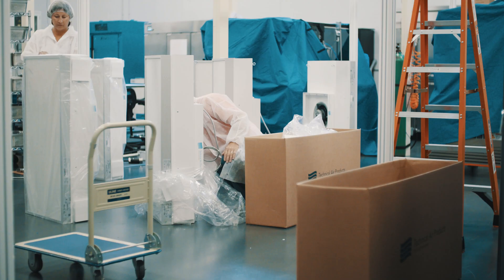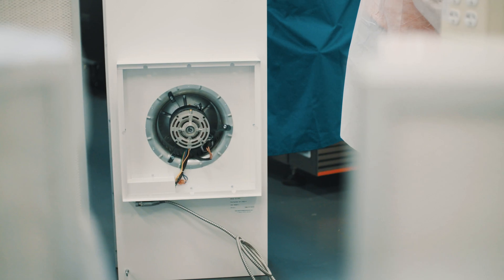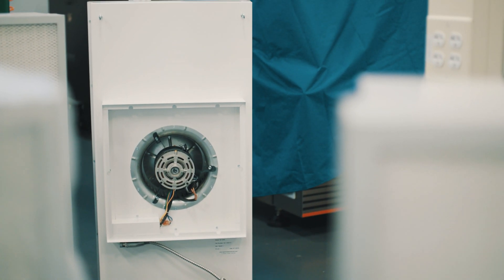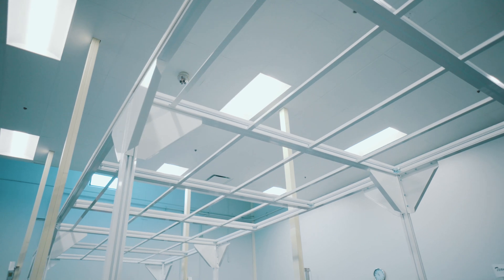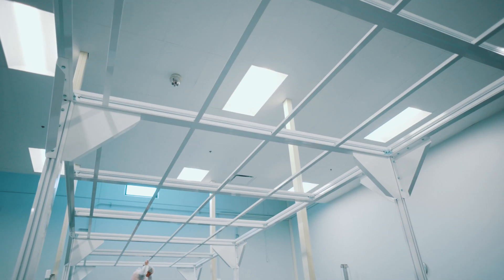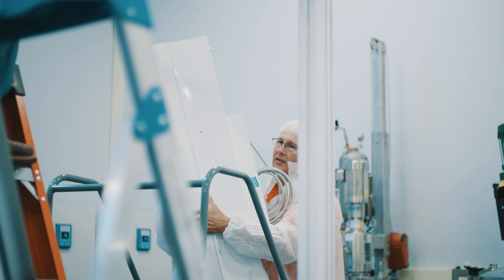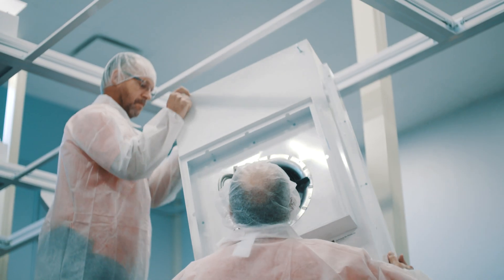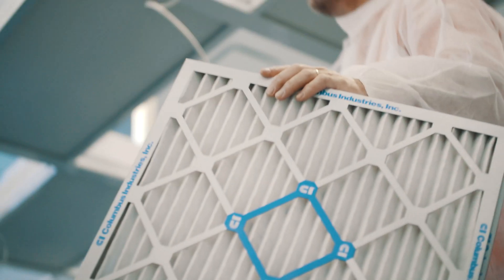The face of the HEPA filters is very delicate. The HEPA filter built into the fan filter unit must be protected from shock, sharp objects, and blunt trauma. Handle the HEPA filters from the outside of the box, not from the face of the filter. If you must touch the face going over the grid, palm it toward the outside of the filter frame rather than pressing with fingers or a thumb in one spot — once the filter is damaged, it's no longer any good.